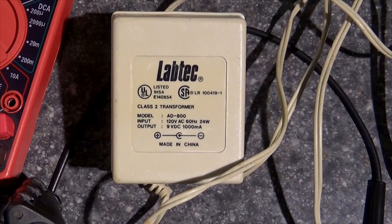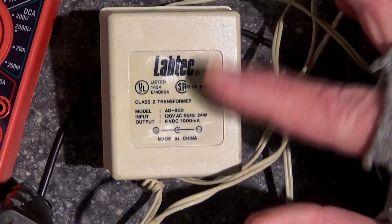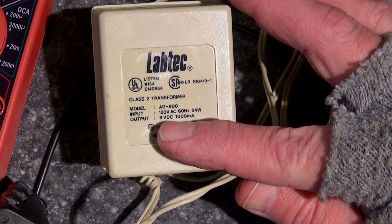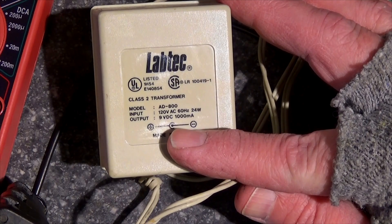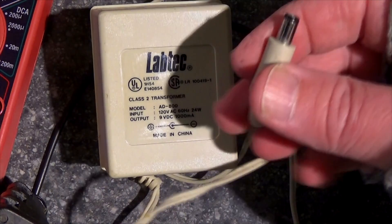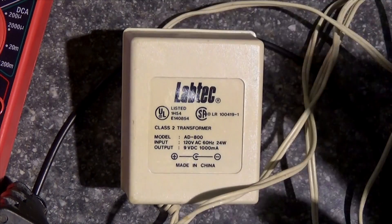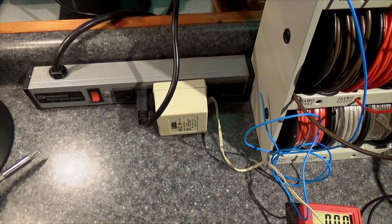I got really fortunate — this is a power supply for a portable computer speaker set. It's 9 volts DC and 1000 milliamps. We needed 850, so more milliamps is fine, and we need to keep the 9 volts. Here's the best part: it's center negative, which is pretty uncommon. We could have still used a different one, but we would have had to cut the wire and switch the leads, or internally change the keyboard itself. We found a power supply that will work.